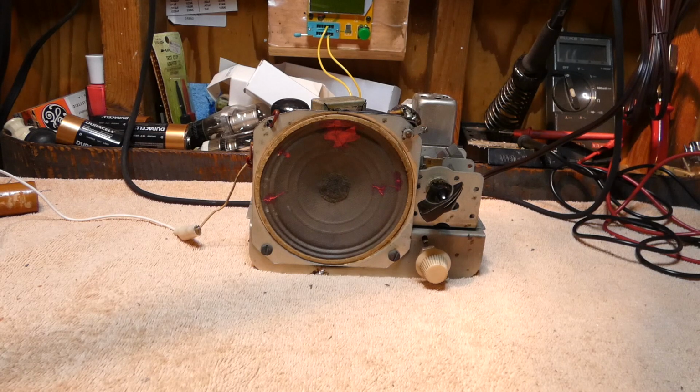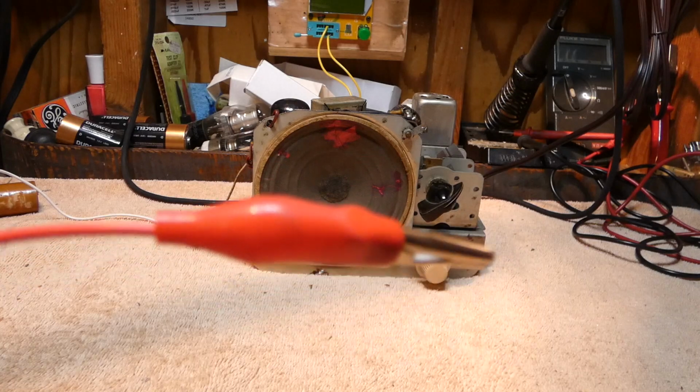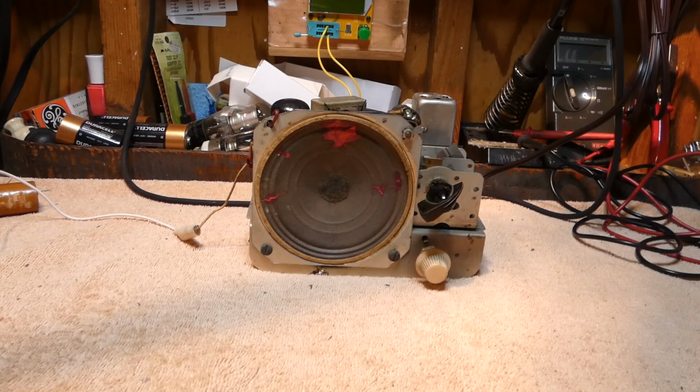So, here's the story of the radio. Right now, I've got on a local station. I have maybe slightly more than 2 feet of this fine antenna you see in front of you here. I've got two clip leads. As it's a four-tube radio, it has a tendency to suffer below 800 KC unless you've got some really close stations.